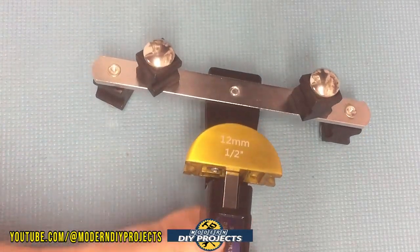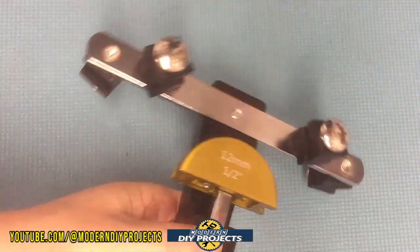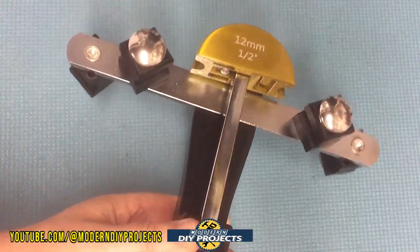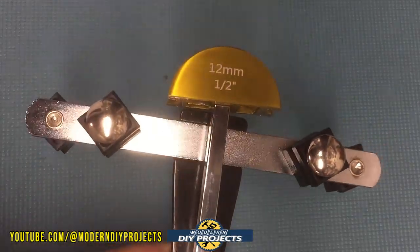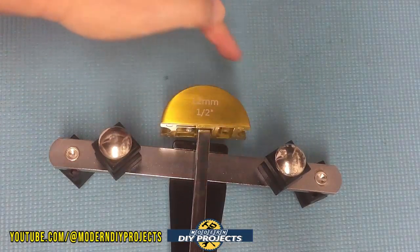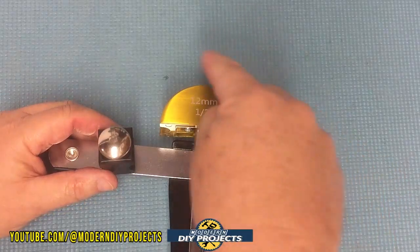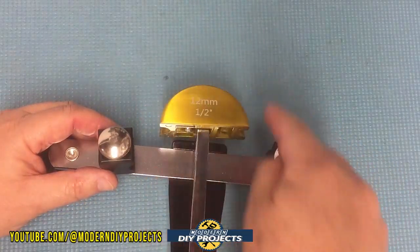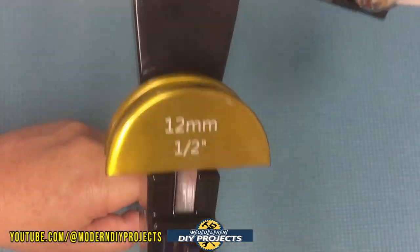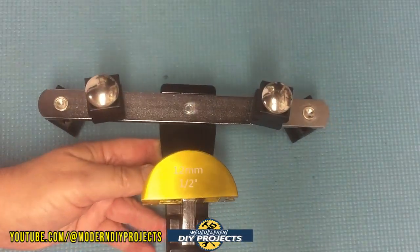And as far as ratcheting, basically what you do is you ratchet this guy and you just keep going. And that's as far as it goes. That's where it stops. And then you see right there where basically what you do is you would have the 90-degree bend going around right there, because these guys will rotate this way. So you have a pipe going this way, you have 90 degrees. So that's how you get that bend right there. And then the handle goes back by gravity. You just put it that way and it slides on back and you're all set and ready to start again. So there you go. So that's very convenient right there.